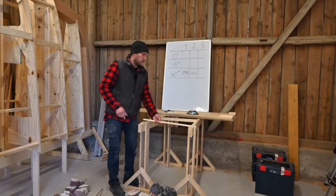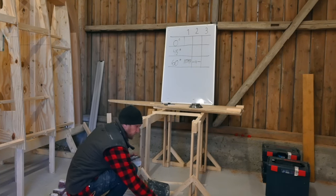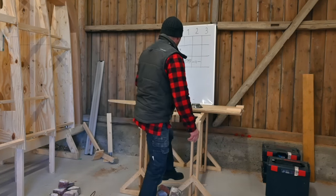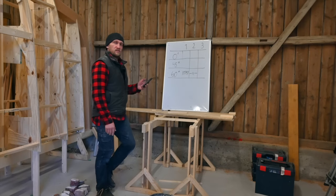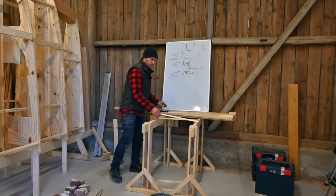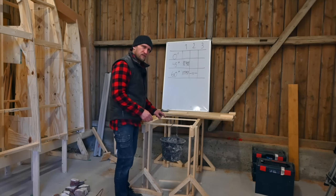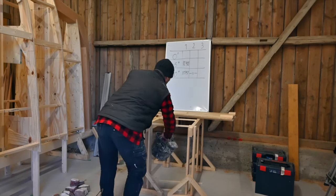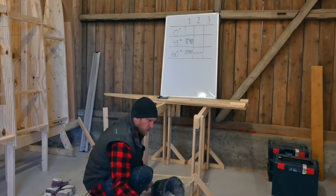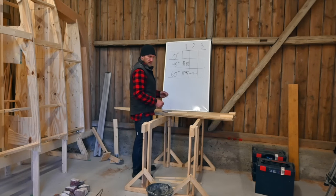Let's try the forty-five degree joint. That was three small stones less — twelve point four kilos. The second sample has the beginning of a defect, a small knot pretty close to the scarf, so I'm thinking this might be a lot weaker than the first one. It was just about half a brick weaker — nine and a half kilos on that one. A bit weaker, but I think that was because of that knot.